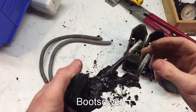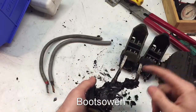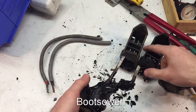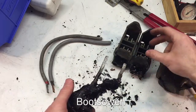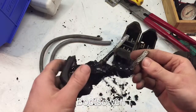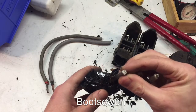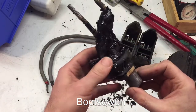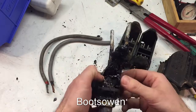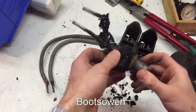So what they've done here actually is quite interesting. They've got the copper cores coming in to the splitter — they've split the copper cores coming into the little circuit breakers here. Well, they are circuit breakers because you have to pull them out and you break the circuit. They've tinned the edges with some solder to kind of hold them together — not seen that before. It's quite a neat little job. I'm guessing the lead comes up somewhere about there — you've got that lead lined copper stuff.